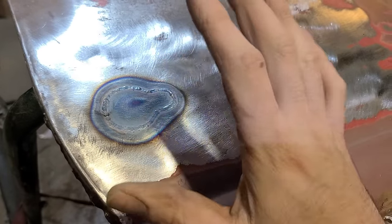And there's really no perfect way to get anything 100% again. Once it's been welded, the metal has now been damaged. The only real way to get it 100% back to the way it was is to tool up and stamp out a brand new fender, and then it would be the same as it was. But obviously that's not realistic, so we just do the best that we can and try not to overthink things too much.